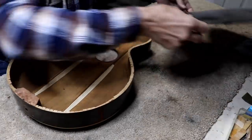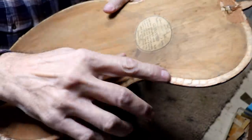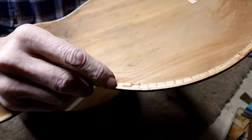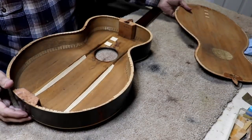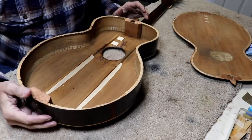It's better to even show it on this side. You can see that it actually cut the wood more than it came loose on the glue. And, you know, obviously the original was hide glue, and you can see that it basically cut the wood more than it actually unglued it. So, you know, the myth about taking hide glue apart as being easy is a myth.